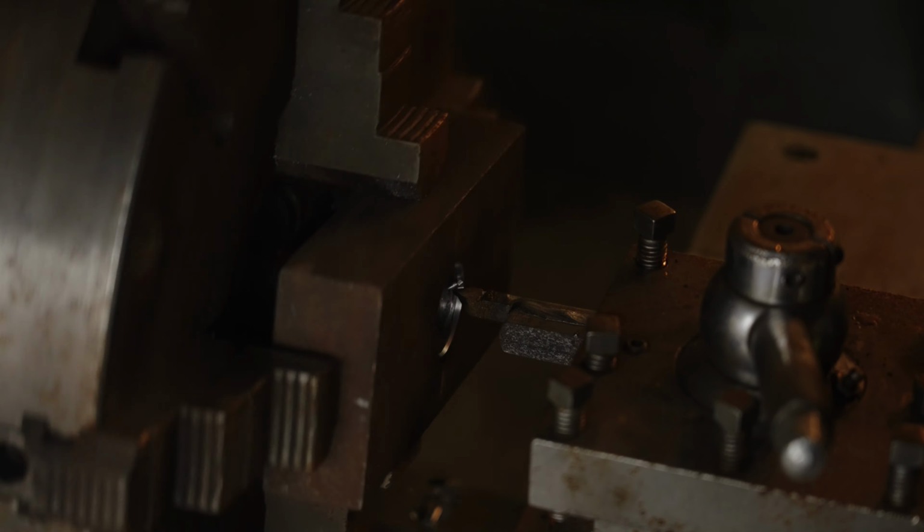So instead we're just going to do the exact same thing, except we're going to use higher quality bolts and bigger bolts. So we're going to tap them in, and then after we've done that we're going to weld up these two parts so they're one bit. And then I'm going to weld the bolts in because I never want them to come out. Bada bing, bada boom, done.